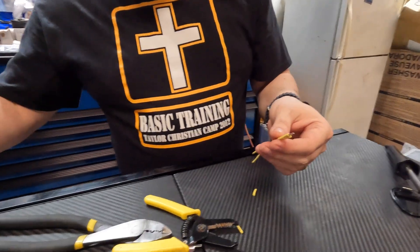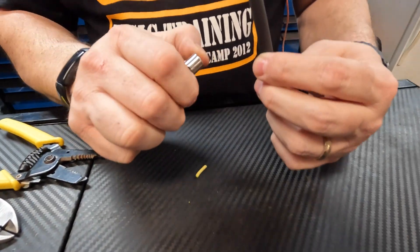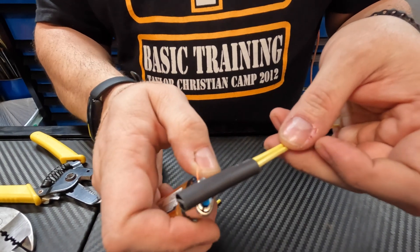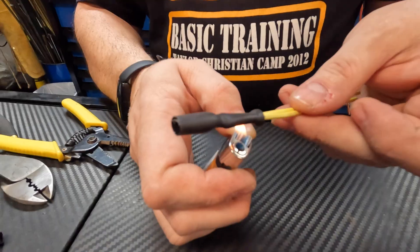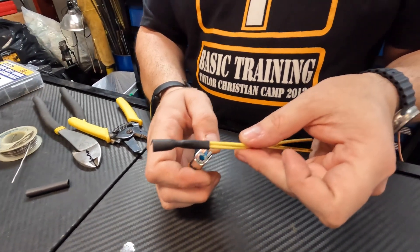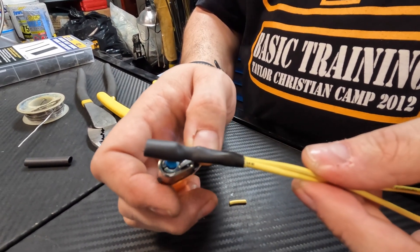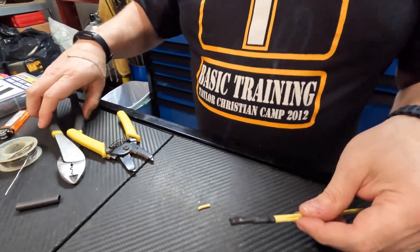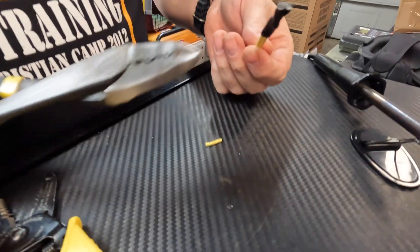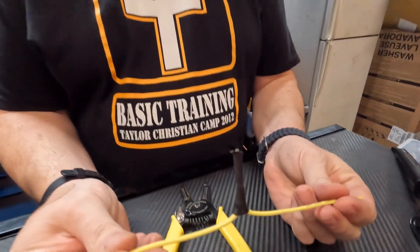And the connection is done. It's that simple. Now we're going to take some heat shrink of the right size to fit over it. Slide that down on there — we're just going to use a regular old cigarette lighter to heat shrink this down. Start in the middle; as this stuff heats up it'll shrink. What you're looking for — if you have it shrunk all the way down — you will see this glue start to come out. When that glue comes out, you know you have a good seal on that side. Move the heat back the other way, it's going to shrink on down. On this end, we're going to crush it and get that glue seal to come out the end. That is a very good watertight splice.